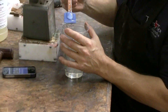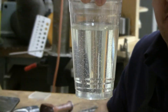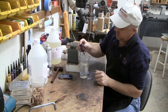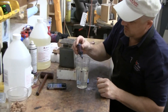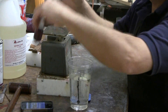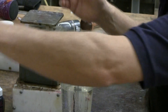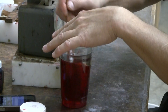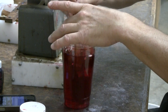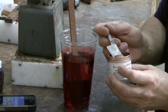All right, now I'm ready to add some color. That took me exactly 1 minute and 40 seconds to get it thoroughly mixed. You can see there are a lot of little champagne bubbles, but those will go away with the pressure. The resin is completely clear with no streaks. I'm using Alumilite's dyes — I use one drop per ounce — mixing up a custom color. I'll also add some metallic powder to give the blanks some body.